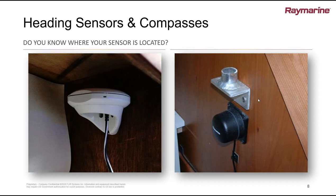Over the winter when people tend to move stores and equipment around the boat or fit new equipment, make sure everybody is aware where this heading sensor is so that you can give it a good wide berth. In a perfect world you'd have it at the center of a six-foot diameter ball with nothing in it — clearly impractical on most boats, so it's always a bit of a compromise. The autopilots do have an ability to detect and compensate for sources of local magnetic deviation, but that will only work up to a certain point. If you stick a 10-inch subwoofer on the other side of the bulkhead, the heading sensor will stand no chance at all.